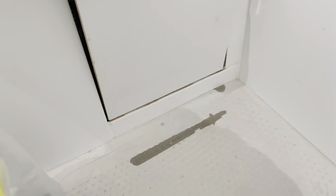Just measured and cut this tile that's going to fit over the panel, and when it goes in, obviously you're going straight, but you're going to have to put it onto the adhesive and then use the spacers to make sure it is stuck onto the panel with equal spacing around, particularly making sure that the bottom is lifted off. And that's essentially it. So next stage is mixing the adhesive and getting it stuck on.